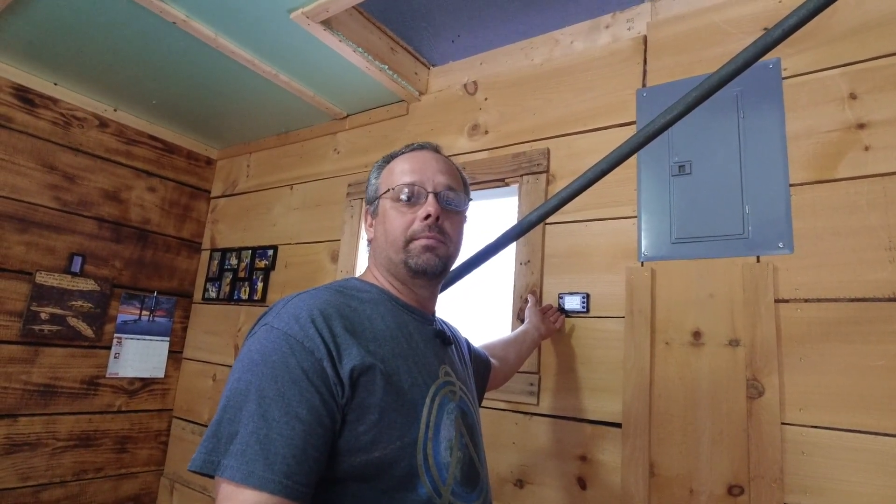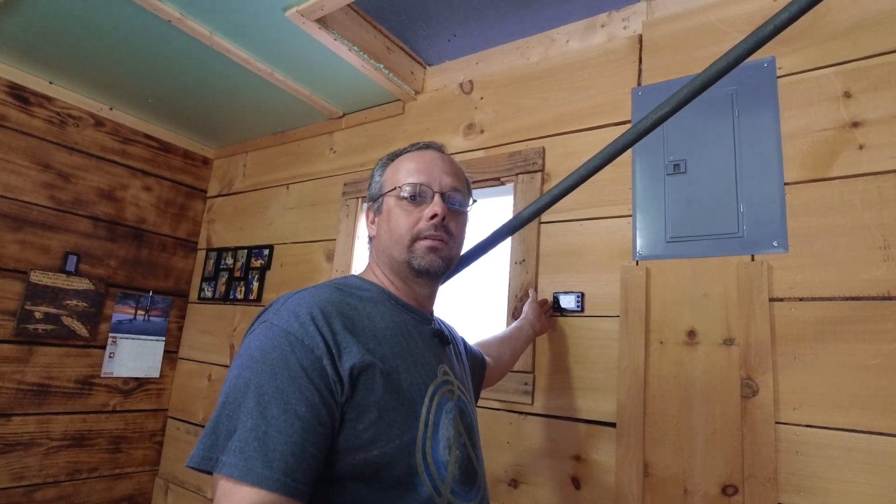If medium is plenty to keep your house warm — or your vehicle or whatever — this would work in anything. It just runs off 12 volts, so it would work in an RV, a house, or wherever you just have to have a 12 volt source. What I'm using right now is a wall wart or transformer that runs the thermostat, and the thermostat itself has a battery unit. For the thermostat, any thermostat will do that would normally run a regular household furnace.